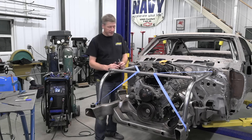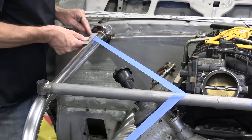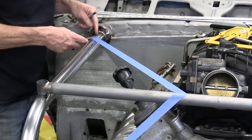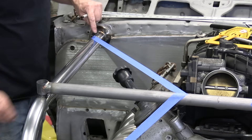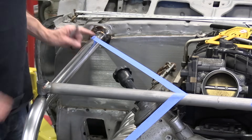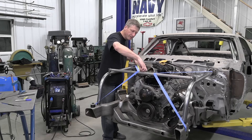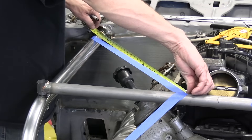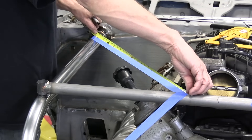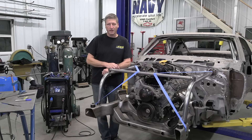To get my overall tube length I just come down to the end of my tape, mark the center line of the tubing on that tape, and then make a perpendicular mark across it. That intersect point is where my bolt hole needs to be. So my overall tube length will be from the long side of the coped edge to that line, which is 27 and 3 eighths. I'm going to make it 27 and a half so I have a little bit of slush room when I make my cope.